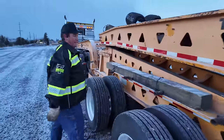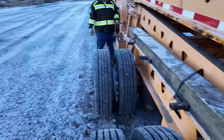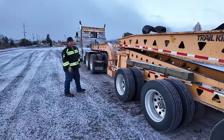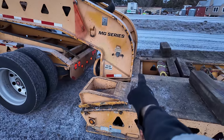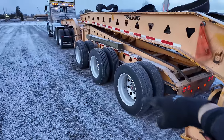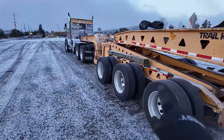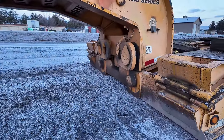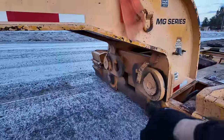I didn't have the airbags but I had the fancy flip-up feet right here, so I didn't have to mess with the block. See, you did have some cool stuff. Now that that pin is latched, this can't fall down. That block's out, fifth wheel is released, pulls forward — as that runs down the ramps that gap closes up. All those pins dropped in and now I can connect the links.